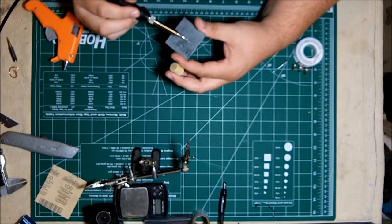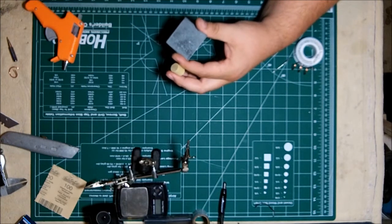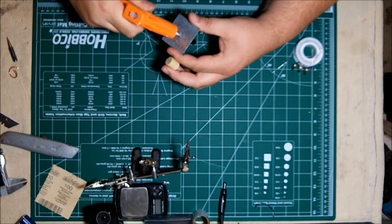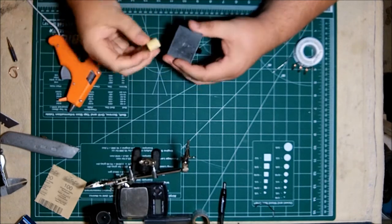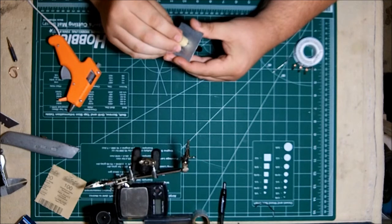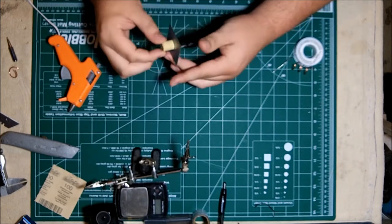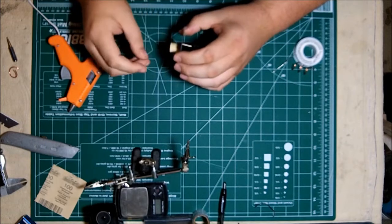Again, I'm heating up the area that the dowel rod's actually going to glue to so that the glue doesn't instantly set on me, which has happened before and I have to start over. And I just put about a dab, about a 1/4 inch round. Press firmly while twisting and do it quick. Even though I heat it up, I don't have much time.